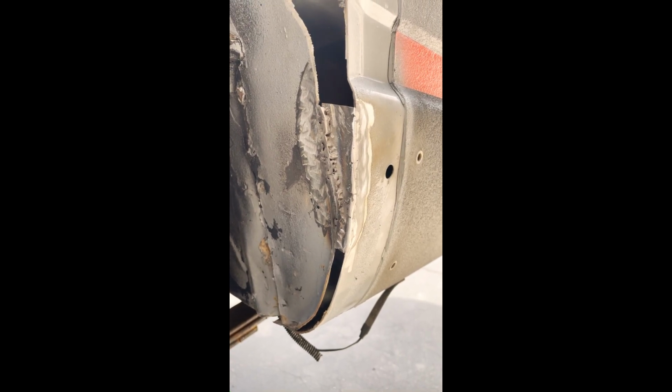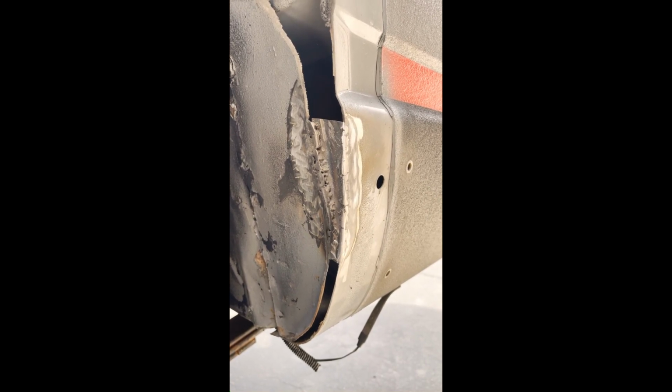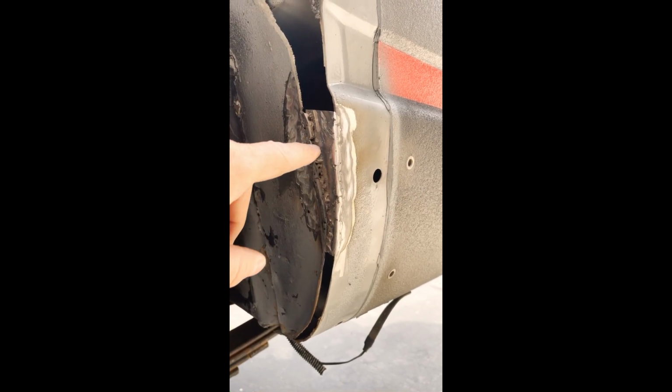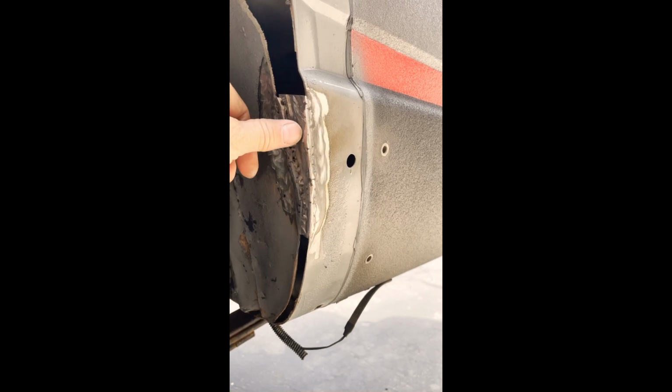But yeah, let's get after it. All right, there we go. One patch in, that's about all I got time for today. The thing I've noticed about our weather patterns is I gotta get it done before noon, because afternoon, the wind starts coming in and then it blows my shield gas away. I have never claimed to be any good at sheet metal. Grind all this off just to see that I'm actually getting penetration between the two pieces.